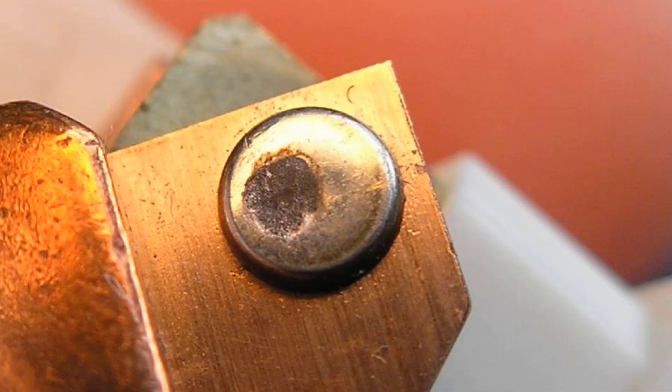These sorts of solenoids are usually turned on and off via a relay contact. That little spark you see erodes away the relay contact and causes pitting. The contact surface will become smaller over time as more of the contact is eroded away, and one of two things will happen: either the relay will no longer conduct and the solenoid will stop working, or the relay contacts will weld together and the solenoid will not stop working.